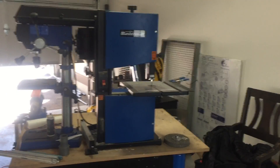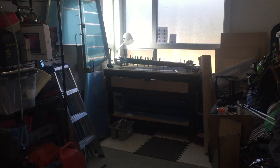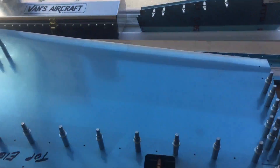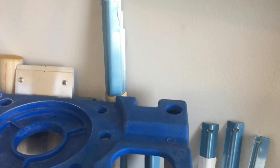Hello fellow aircraft builders, here in the new garage getting some work done on the elevators of my RV7, which are sitting there on the bench. I do have an old kit that requires me to drill my own skins. These are not CNC punched, as you can see, for my stiffeners. But I cheated a little bit — rather than using stiffener material without holes, I bought all the new stuff that does have holes.